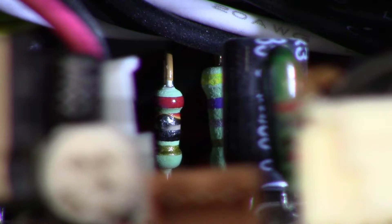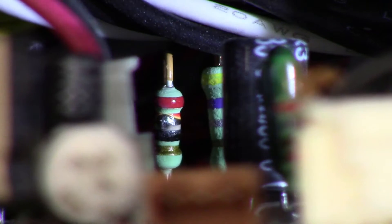So one of the things I see right off the bat is, look at that resistor. That's a low value resistor, 2 point something, maybe 22 ohms. Looks like red, red, black, but look right in the middle of that — you'll see a big melt spot. Trying to move the light around so you can get a better view at it, but that looks bad.